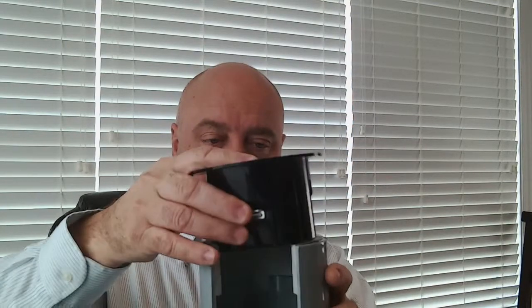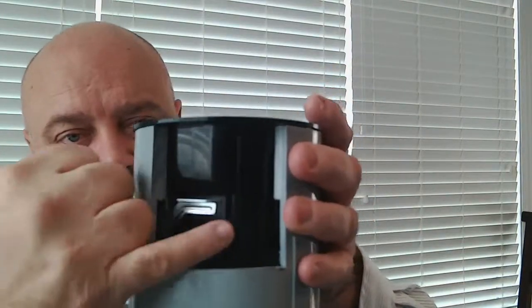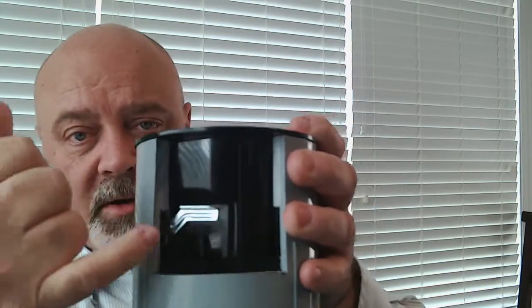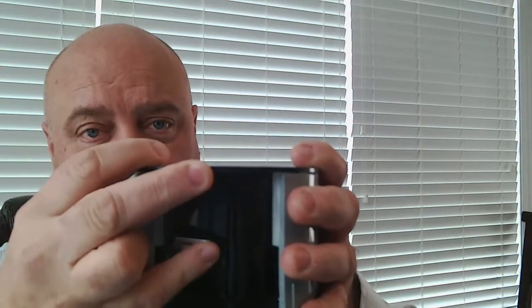So it's a very easy install for an electrician to do, or even a builder or any end user. Once it's there, you've already put the PVC cement in here, so it just gets glued in, and it's level to the top of the box. The gasket is installed, and then you'll take your FB3. It'll work with an FB3, FB4, or a 7 or an 8. It will slide into the box, and then you'll tighten it up. When you tighten these screws, these metal wings will move up, similar to a toggle behind drywall, and lock that box into place.